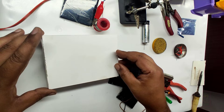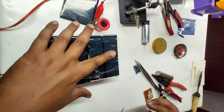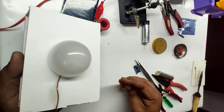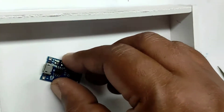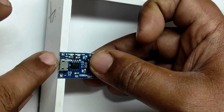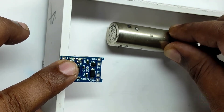What we are planning is to use two solar panels in parallel so that we will get maximum current while charging. We will glue the solar panels on one side and then on the opposite side we will fix the LEDs and cover them using the diffuser. Inside the box we will be fixing the BMS, mostly at the bottom of the box, by making a small opening for the micro USB port. We will fix the battery somewhere here by gluing it.